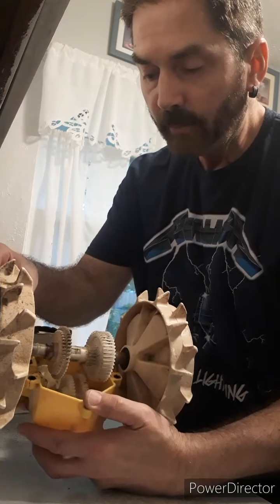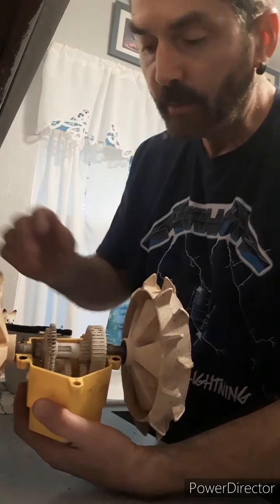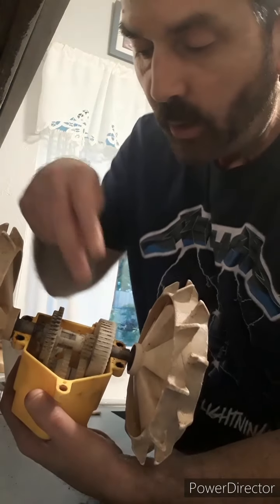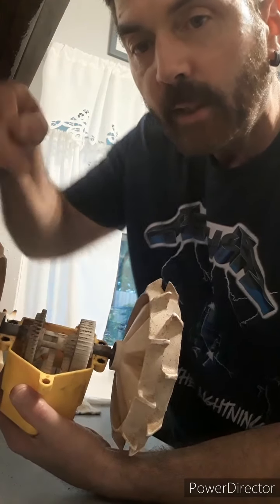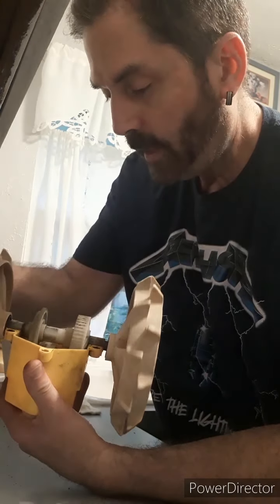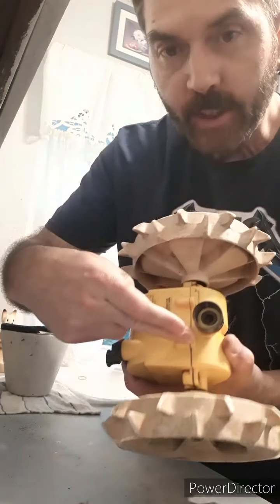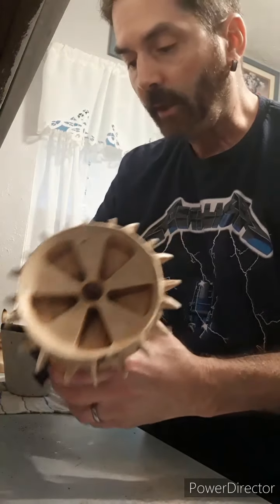Just drop this one gear right in between those and see how that fits. Before you screw it down to the base, check your gears. When these wheels turn, you can see some of the gears inside turning as well. It is in neutral right now, so only this one gear will turn. If you slide this over into gear, it will engage other gears down in here - that's what drives this thing when the water goes through. Make sure everything is turning free and the gears look good. Replace your cap, make sure it all fits nicely. There are tabs on the front - make sure those all fit before you start screwing things down, otherwise your housing will crack.